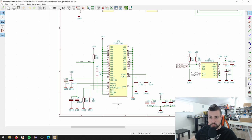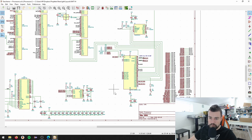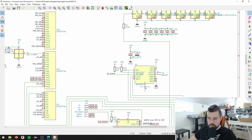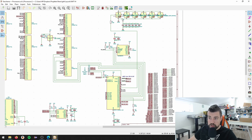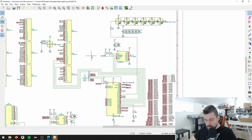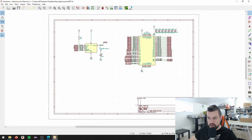In a while we're going to go through the bring-up of the hardware and see what is necessary. I added an accelerometer, an ESP32 Wi-Fi module, a MAX chip that's an I2S audio amplifier connected to the Wi-Fi module, and some WS2812 LEDs. I have a sheet called connectors - it's not just connectors. I have a USB connector with a charger that can charge my battery, a voltage regulator, a backlight driver, touchscreen interface, and memory.